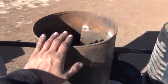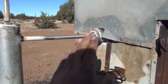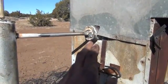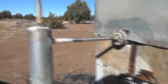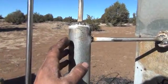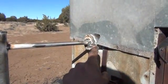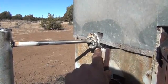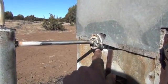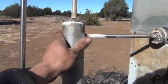Here's our bio-crude feed into our thermal cracking unit inside of the wood stove. If I show you inside of there, you can see it running through. We have catalyst metals inside of our first reactor here, like aluminum oxide and others, which are all powdered down to a powdered form. We also have another base of catalyst metals inside of our secondary catalyst reactor here, and these are dry catalysts, where this will be a molten catalyst. I need to let it get hot before I start feeding the crude oil into it. Those will react with the crude oil and produce a lot more gasoline than a diesel and fuel oil product. So that'll go into our secondary catalyst.